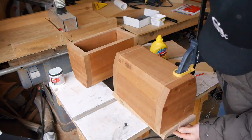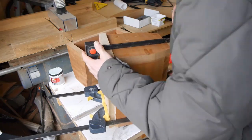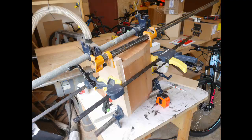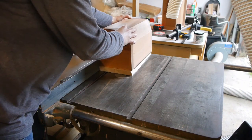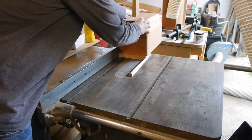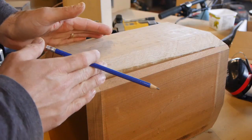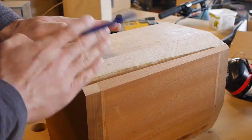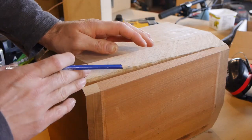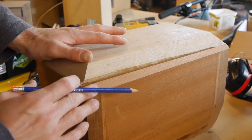And then I glue them to the speaker. Because this is solid wood, I want to use a lot of clamping pressure, make sure everything's tight. I was really checking to make sure the wood seems stable and dry as I cut it and planed it before I moved on. Now that that's on there, I cut a chamfer to get rid of the excess off the baffle. On my piece of maple here, I didn't really have a wide enough piece to do what I wanted to do, but I thought I was going to get away with it. I thought there was going to be more space here to cut a chamfer. I knew it was going to be close, and I thought I might have an angled chamfer or something like that. But then when I glued it on there, I instantly realized that it was way more than I anticipated.